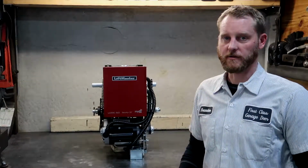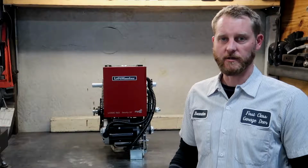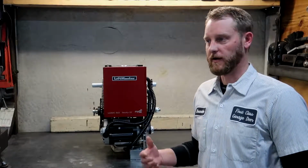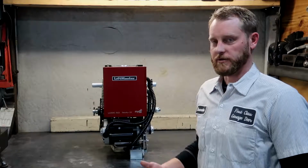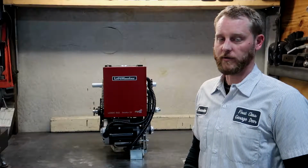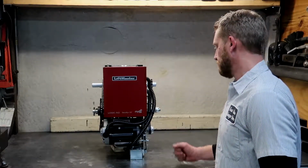One other thing I wanted to touch on as far as the bearings and modifications is that it's always best to consult your garage door professional regarding any modifications or application. We did do a video on selecting the right commercial door operator. We'll put a link in the description. In that we go over what type of operator, voltage, motor horsepower, as well as usage. And as far as usage goes, these Model H units are rated for no more than 25 cycles per hour and no more than 80 to 90 cycles per day. Again, all the Logic 5 Elite Series units come with a 2-year manufacturer parts warranty. And I think that's about it.